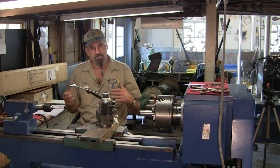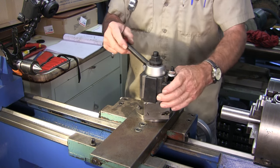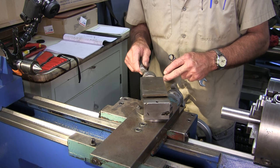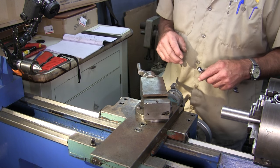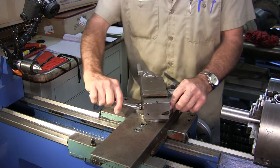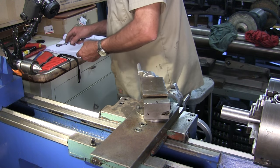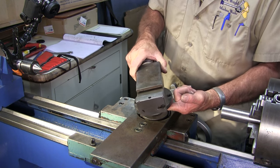We're going to start at the top and pull off our tool post, setting items over on the cabinet by the shaper. The compound is fairly tight — I'm only getting about ten-thousandths play in the screw. We can clean this at another time, but I don't think we're actually going to do anything to the lead screw or lead nut — maybe a little gib adjustment. And I think it just pops right off the top.